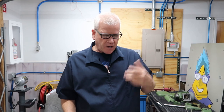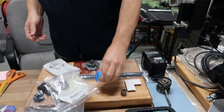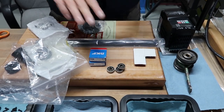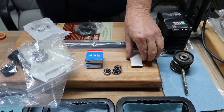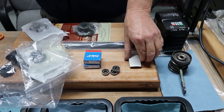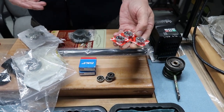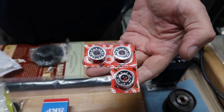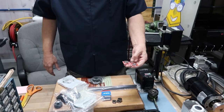It's going to mount on the pole here and hold the German micro tapping machine — the one we couldn't pronounce the name of. It needed new bearings. We originally had FAG bearings; we took those out and went hunting. We always default to SKF, but we were able to find the same FAG bearings, the originals. We always try to replace with the same bearing when at all possible, and we did.